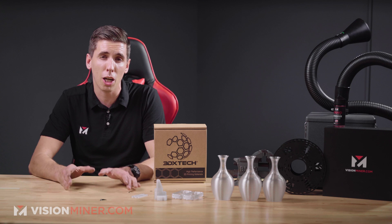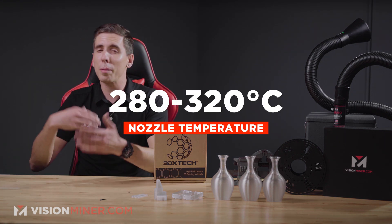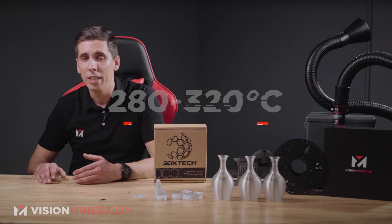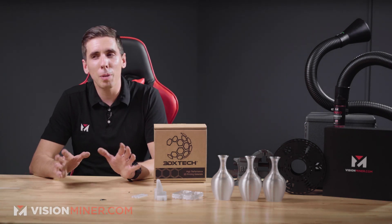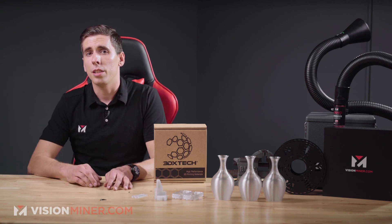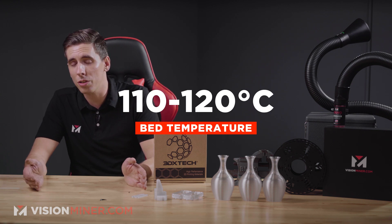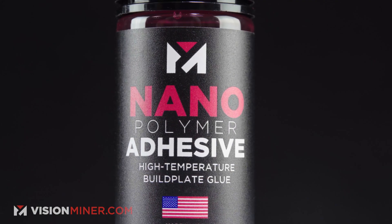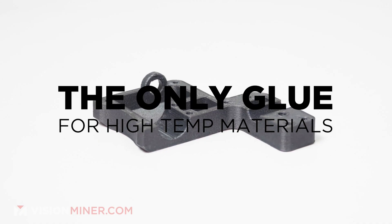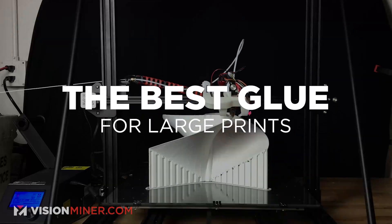Let's get right into what kind of machine you need to print this filament. First off, your nozzle temperature needs to hit at least 280 Celsius, all the way up to about 310 or 320. If you can't hit that, your layer adhesion won't be as good. As far as the bed temperature goes, you're looking at anywhere from 110 to 120 Celsius. With your nanopolymer adhesive, it actually sticks down really, really well, so you want to make sure you have a bottle of this before getting into PC because it does love to warp.